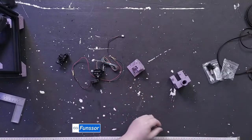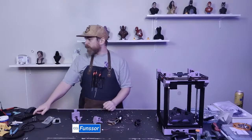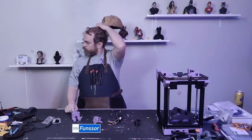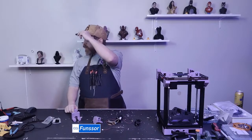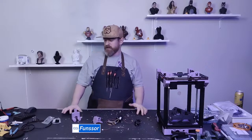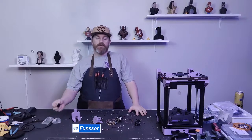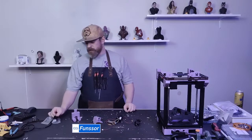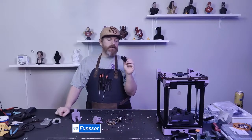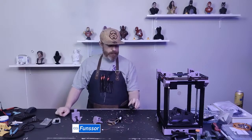but you never know, right? Yeah, Orbiter V2, I totally agree. It's my favorite too. I have one on my scalable that's right next to the camera. I do like the HGX just because of the price versus performance. It's a fantastically performing extruder, you just purchase it and use it, there's no assembly. Same with the Orbiter, it just works, but it's more expensive. I do like Sherpa and Sailfins as well, but they do require you to assemble and build it, unless you buy pre-made kits with printed parts.